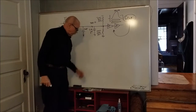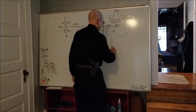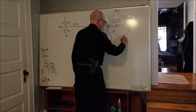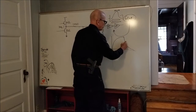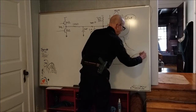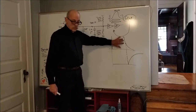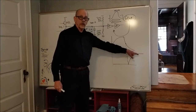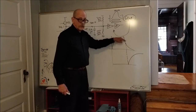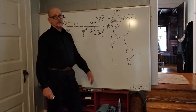And just to prove that it didn't get much better if we instead ran two different RCs, one of which went like this, and when we got up here and triggered, then we would drive this guy low. We would wait until he crossed the negative threshold. Then we would signal another node to start doing its thing and doing the same thing back to us. That way we at least gave this RC a head start on getting toward ground before we started driving the other one up, which would tend to keep these guys going between ground and the switching point rather than hovering in between. And in fact, if we didn't wait for that, we discovered that we did hover in between, and we were burning more like 120 microamps.